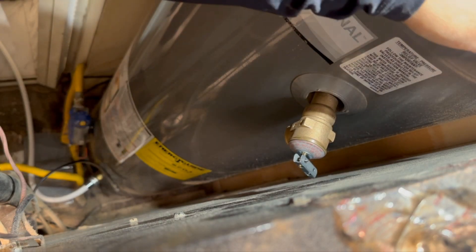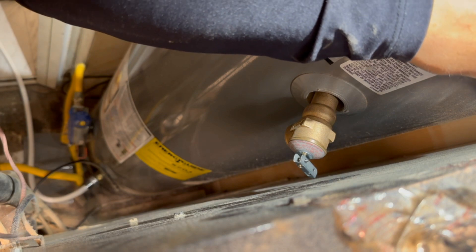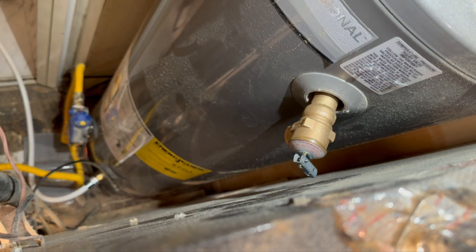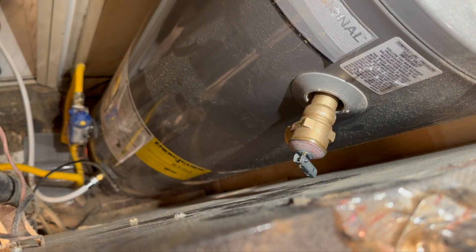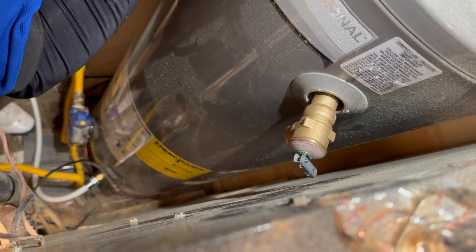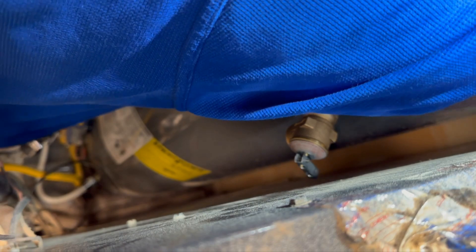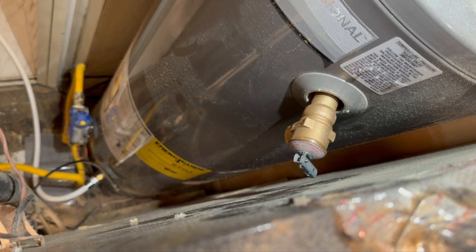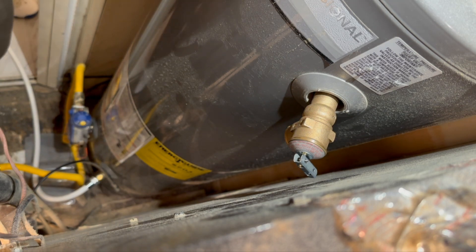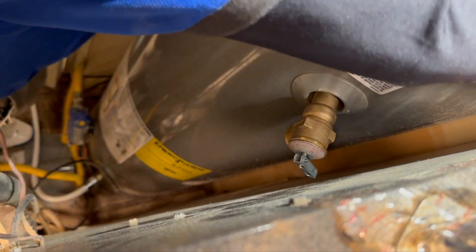When you're tightening this, you hold on to the spot. The old days the rubber used to be a lot thicker and better — they're thinner now and you can crush and deform them, so it's good practice to hold steady. We don't need to wipe the pipe yet; we're testing the unit. We can open up the valve since I shut off the drain valve on the bottom. I didn't crank it down to close it, so it opened right up. You can hear it filling up now — this means I've got to shut off the tub. I'm leaving the tub open a little bit so I can hear flow and get all the air out of the system.